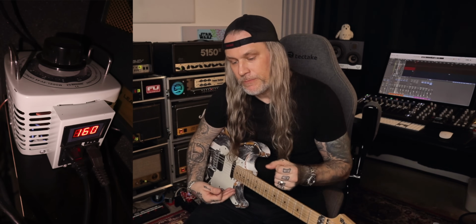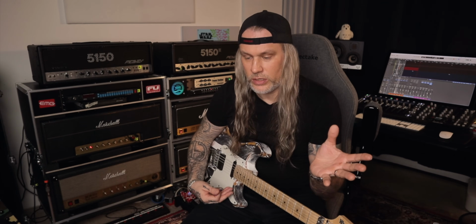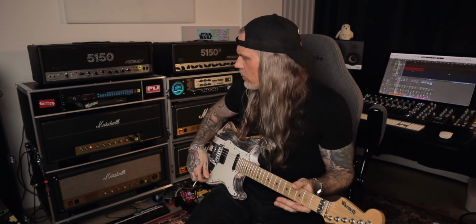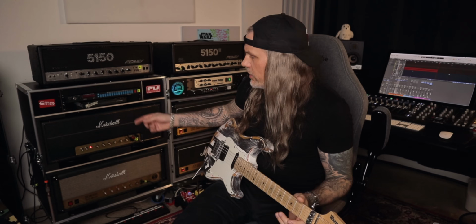I'm using it at 160. On my recent videos, I think I was using it between 140, 170 or 160. But now I've had the amp for a couple of weeks and I found that I like the response, the feel and everything the most when the amp is set to 160 volts. Because here in Europe we get from 220 to 240. I'm getting around 220 here in my studio, so I'm reducing it to 160 volts, so about 73-74%.